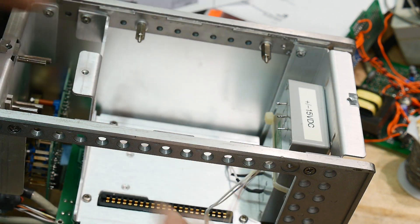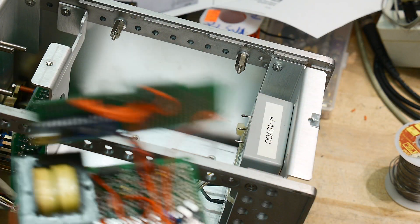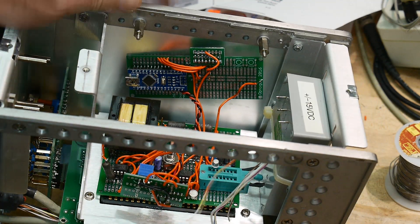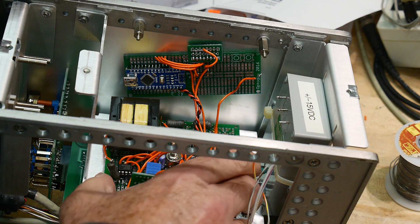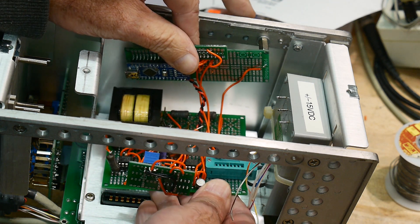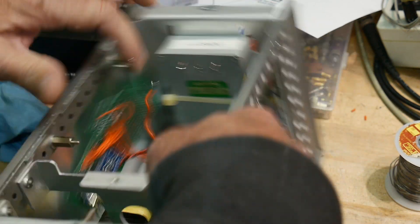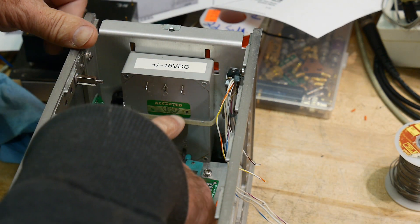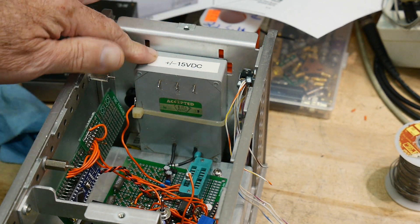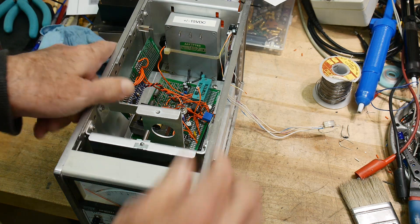Because I don't need this board any longer, I have lots more room inside the chassis. What I need to do is take my circuit and stick it in there — I guess it'll fit. I need to figure out how to mount it all in there. I'm contemplating laying out a PC board to make it all nice and pretty someday, but I'll leave it like this for now. I think it'll be good. That solves my power supply problem — now I've got plus-minus 15 volts, officially certified. I don't see a date on it, but I'm sure it's a few decades old and still in great shape. So that's what we'll go with, and I'll continue on my journey.